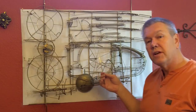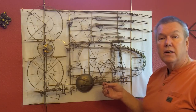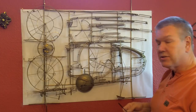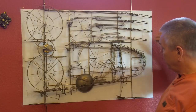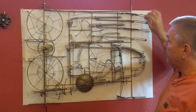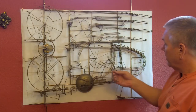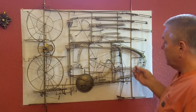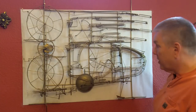This clock also has a feature of striking, so it will strike the full hour when it reaches the full hour. There's an accumulator section over here that keeps track of that — it's separate from the main racks. There's a sensor that comes across and feels for the number of balls stored on the back side, which matches the number of hours.